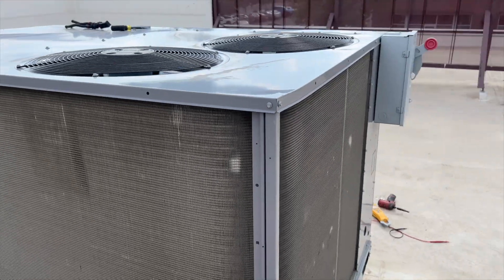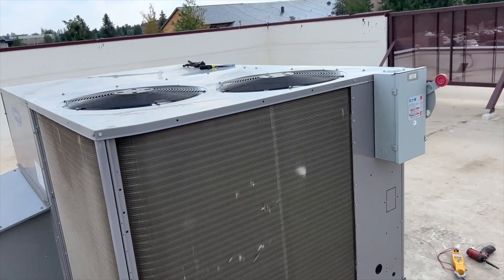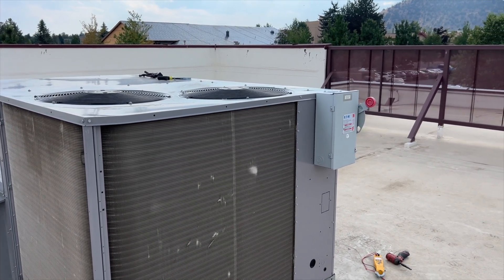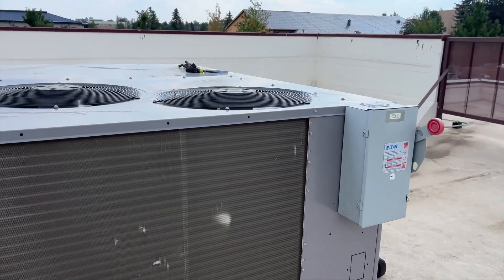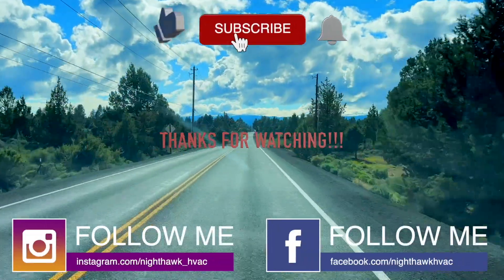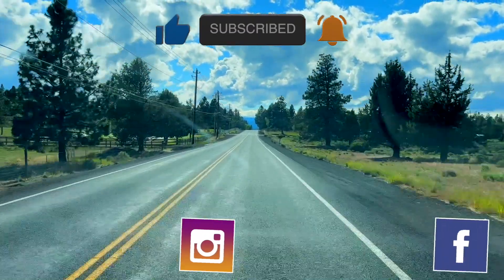If you ever come across one of these situations you can totally bypass the VFD - they made it super easy. We recently had a major power outage so I'm wondering if that damaged the VFD, or it's possible the little mini cooling fan on it quit working, because those fans go out all the time. If it runs too long it can overheat and cause it to blow up. Hopefully this helps. Thanks for watching - like, subscribe, comment, hit the bell notification, and follow me on Instagram and Facebook.